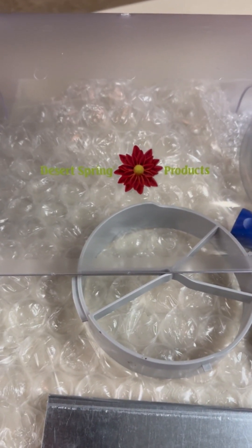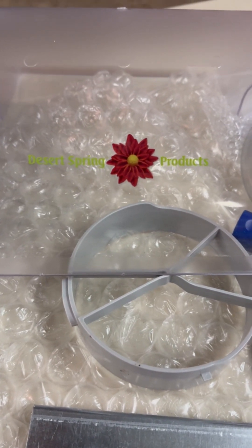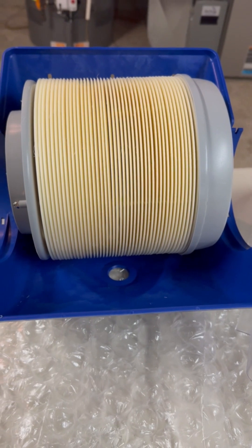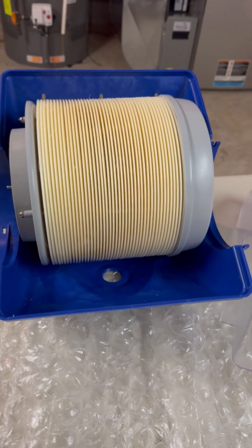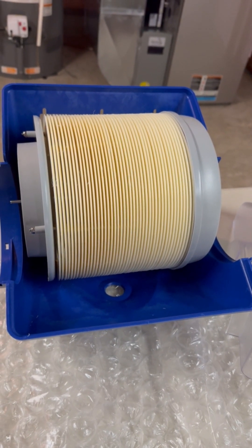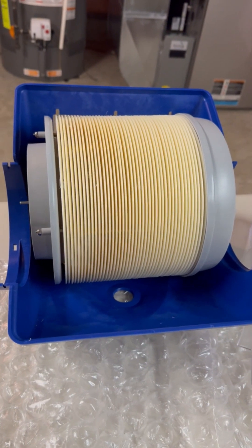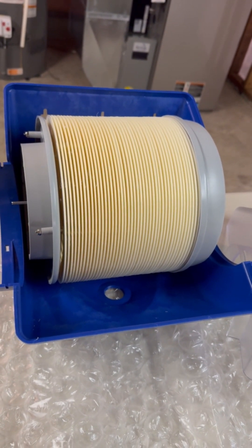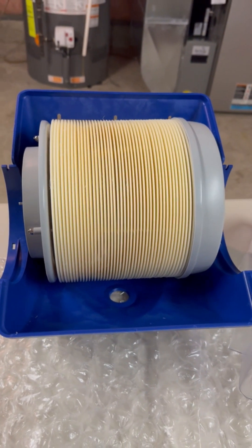Here's the product I'm going to try next on my heat pump and furnace combination. It's called Desert Spring, which has been bought up by General Air. It's a rehash of the old standing-water humidifier with the drum, except they've replaced the drum with a series of plastic discs. These discs rotate through the water, pick up moisture as air blows through them, and pass the moisture into the house. The benefit of the discs is they don't get calcified and lime-covered like old drums, which had to be cleaned about once a month or else they'd harden up and become useless.